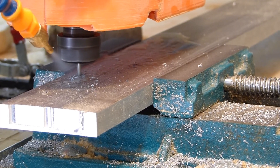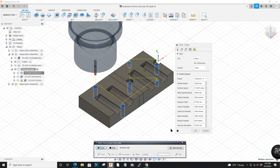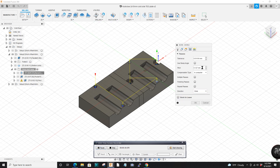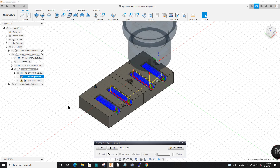I'm using the Fusion 360 aluminum roughing setup, and it's visible here. One thing that I've changed is the depth of cut — the way the roughing setup sets it up is a little too deep for my machine and I tend to break bits. So I've set it around 0.1 millimeter. It's moving so fast that every time it goes around it's taking one tenth of a millimeter off, and that little bit has to remove the material. If it can't remove enough material, then it breaks.